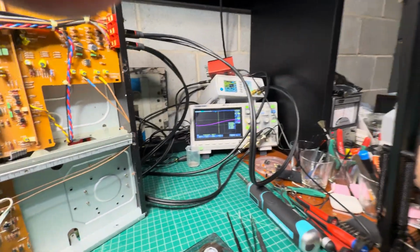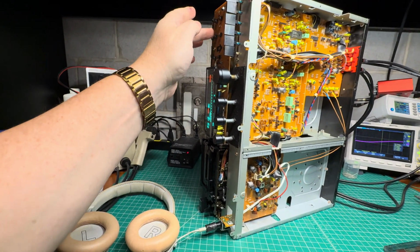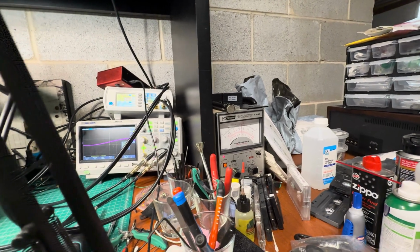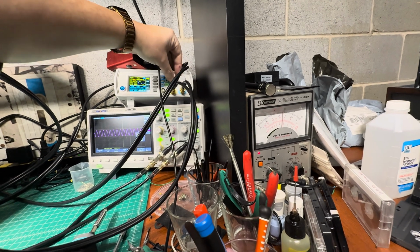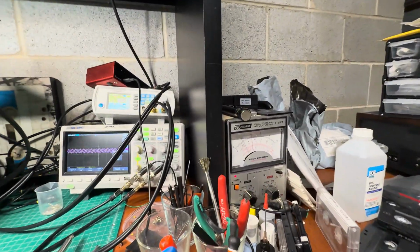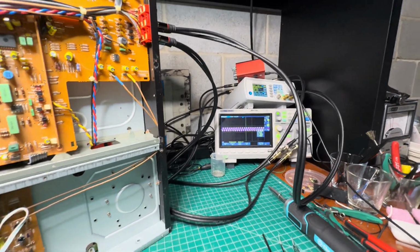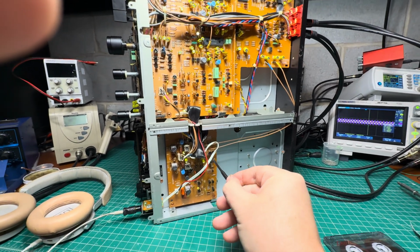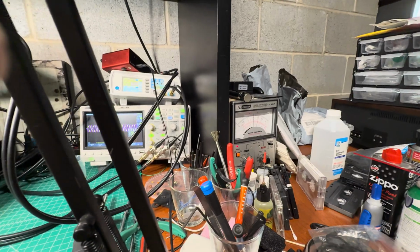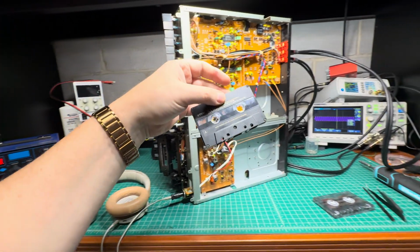Now, type 2. Recording. All right. Source, tape. Good levels. Now we can adjust bias. 10 kilohertz, 400, we don't need to change. 15 kilohertz. Ah, it's source. Oh, tape. Now it's low, and I don't like how it looks. HX Pro on, doesn't change much for some reason. Let's adjust the chrome bias. All right, that's better. Left and right channels are not even, but on this tape, compared to type 1, I always have about 1 decibel difference.